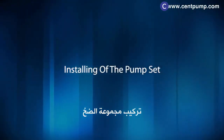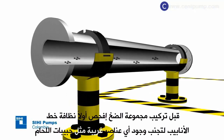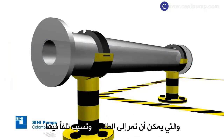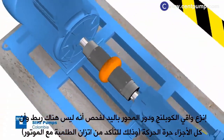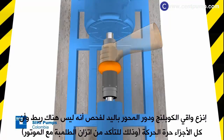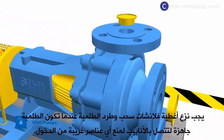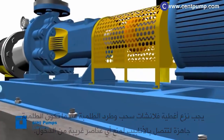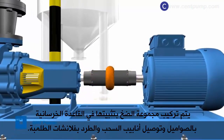Installing the pump set. Before installing the pump set, check the cleaning of pipelines to avoid foreign elements such as welding beads that could pass to the pump and cause damage to it. Remove the coupling guard and rotate the shaft by hand, checking that there is no binding and all parts are free. The protection caps of the suction and discharge flange must be removed only when the pump is ready to be connected to the pipes, preventing any foreign elements from entering. Perform the installation of the pump set by tightening the foundation anchor nuts and connecting the pipes to the pump.